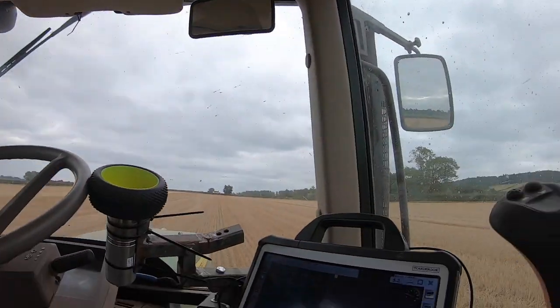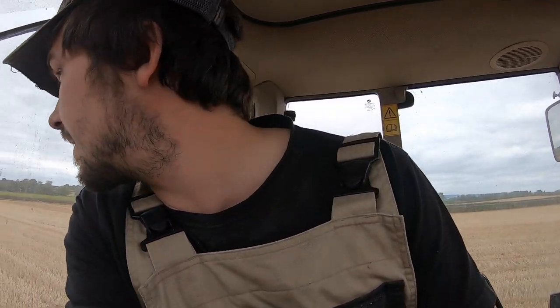Other than what I was saying — it just does have a habit, if the cultivator pulls to one side, the auto steer does have a bit of trouble just keeping the front end pointing in the right direction. But like I say, not a massive issue. Most of the time it's within about four centimetres. It is going pretty well and I'm very pleased with it.